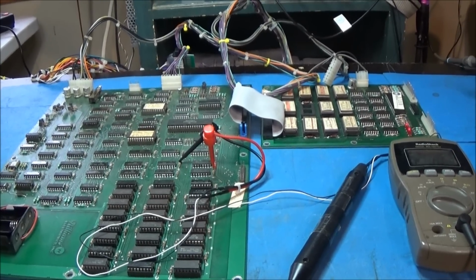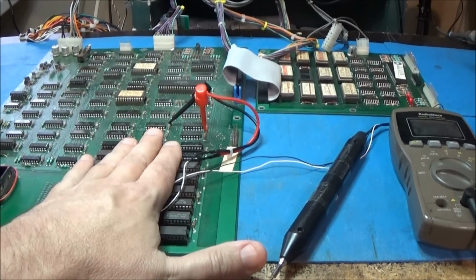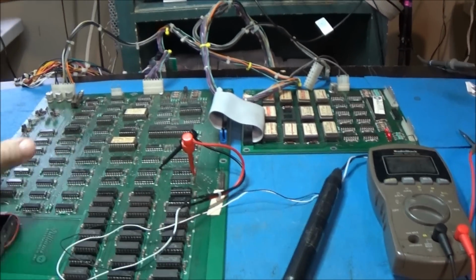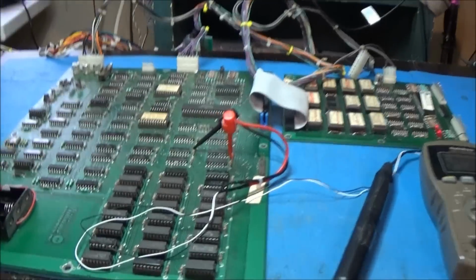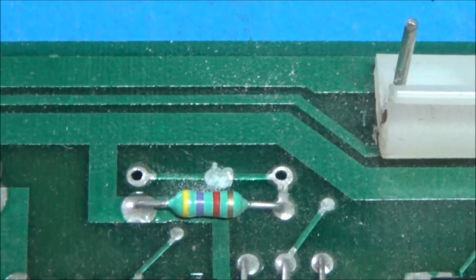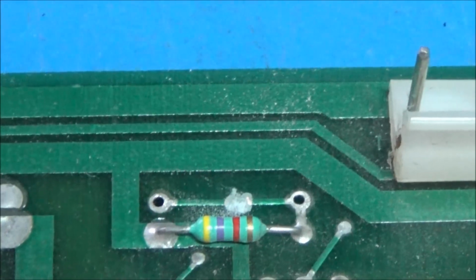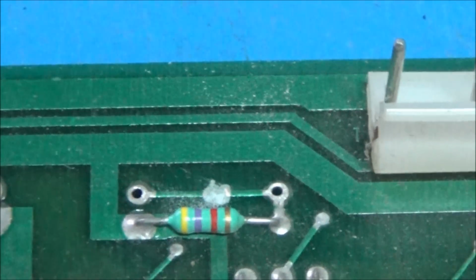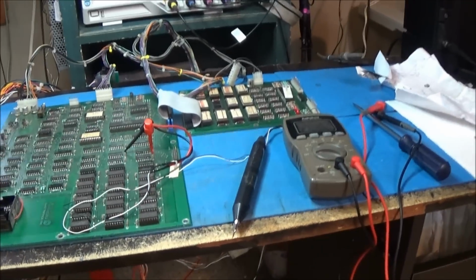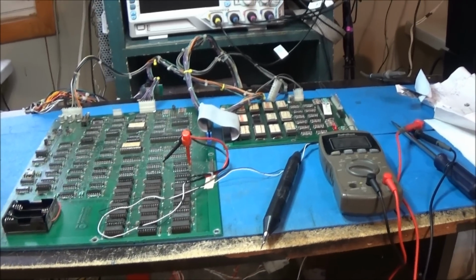So what I am going to do, and I've already talked to the owner of this set, is we're going to do a mass renewal on this thing. We're going to replace all of these sockets, convert to 4164, clean the legs up really good, and recap, new caps where they're needed. Before I did anything, I cleared those holes, and I used my Dremel to break that trace right there so that this thing would display on my screen properly. When I'm done, I'll put a 0 ohm resistor, a short basically, to short that trace so that it'll work in the cabinet how it's supposed to. It inverts the sync to work with my monitor.